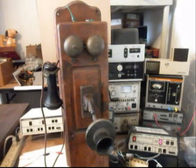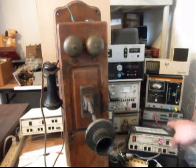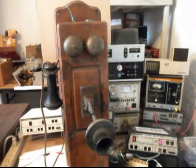So that will give you not your dial tone per se, but it will give you your talk power. And so those connections would be for tip and ring, basically, or your battery. So what we want to do is some checks now. I have the unit hooked up to the analyzer, and we're going to use the analyzer like the other telephone, like the crank. And so we'll go ahead and ring the unit.